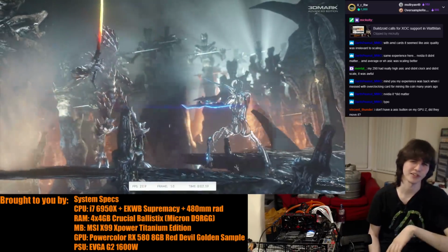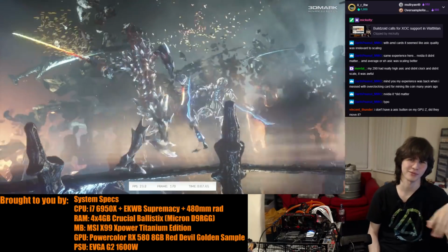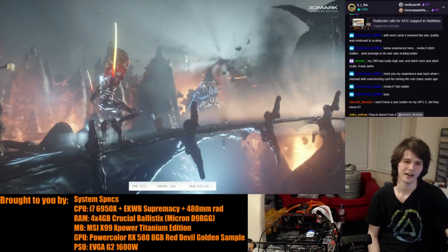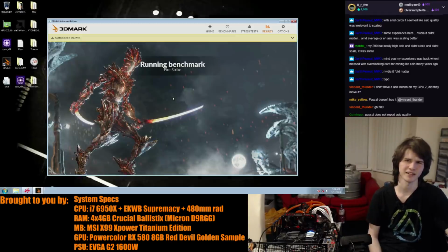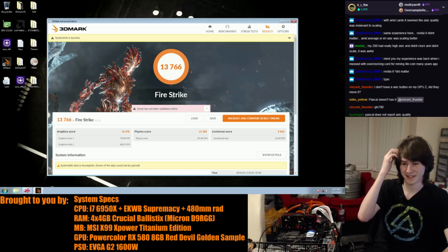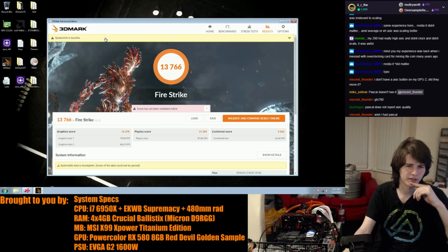But I don't know how it trends. I don't know if it's consistent across the rest of the AMD GPU lineup, or if it changes from card series to card series. So on 7970s you want high ASIC, according to Lumi, and I'd be inclined to believe that because even my 7950 has a relatively high ASIC. Okay, well those timings didn't do shit. But the 7950 definitely has a higher ASIC than my 7970 Vapor-X, and it does clock higher for a given voltage. But we'll see how they do on liquid nitrogen.